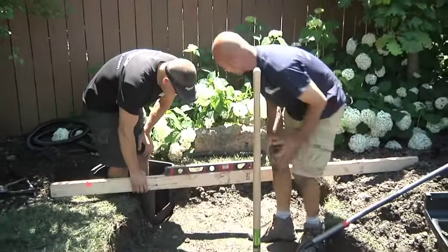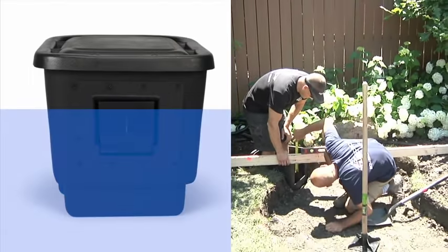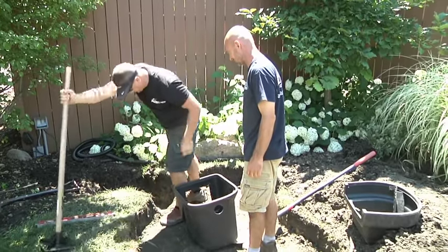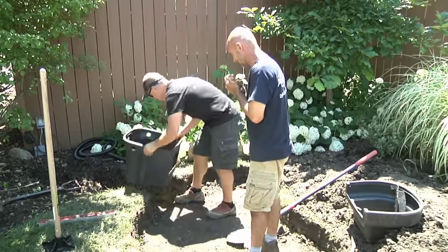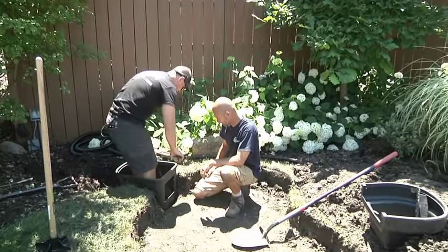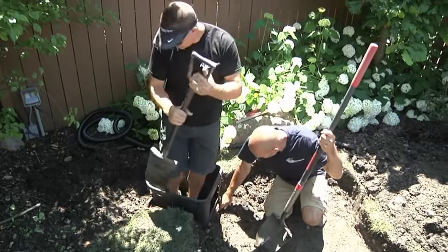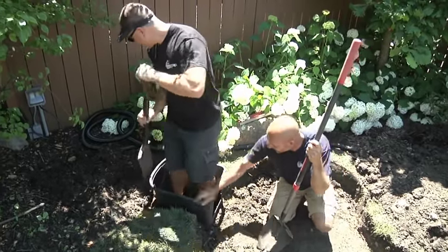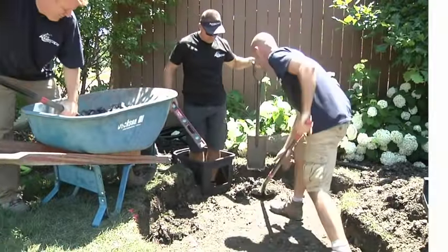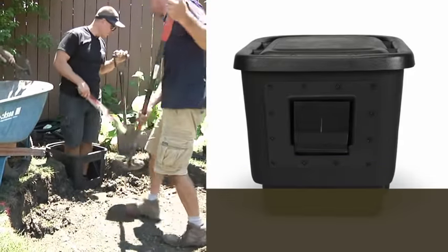The skimmer height is determined by the opening on the front of the unit. Proper water level will rest roughly one inch below the top of the opening on the skimmer face. Be sure to tamp the ground beneath the skimmer to create a solid level base and avoid future settling. In order to function properly, the unit should sit level side to side as well as front to back. Once level and set to the proper height based on your water level, backfill around the filter with loose soil while standing inside the unit to prevent it from shifting. Recheck the level after backfilling and be sure that the depth of the shelf in front of the skimmer is several inches lower than the bottom of the faceplate opening.